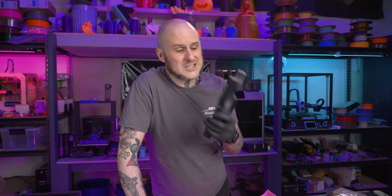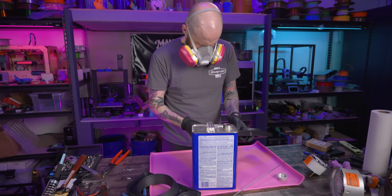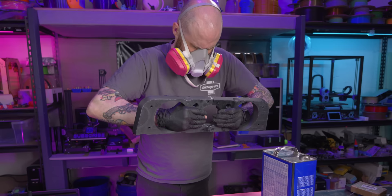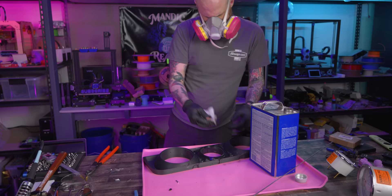As both of these are ASA, I'm going to be using acetone to do the job. If you aren't familiar, acetone will melt ASA filament when applied to it — ABS as well. So I'm going to use that to my advantage and create a bond via that melting. I'll apply a liberal amount of acetone to both of the mating surfaces and then, using the dowels to guide it into the proper position, I will clamp it together — I'm functioning as the clamp myself — pushing it together and allowing that chemical bond to happen because the two sides are melted and kind of melt into each other.